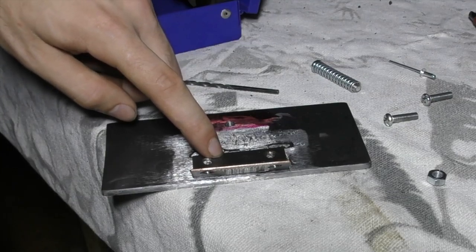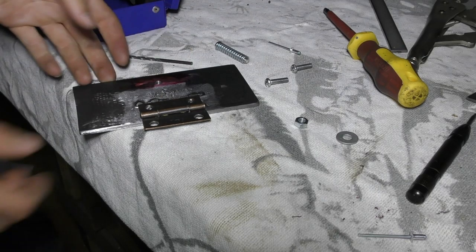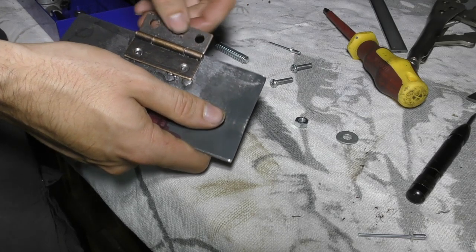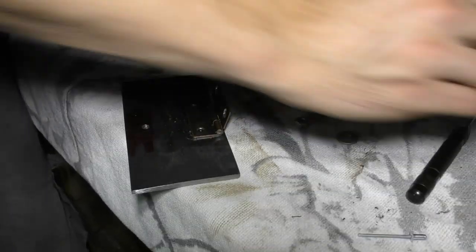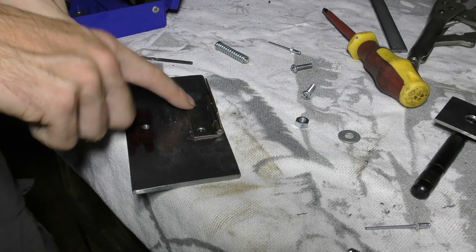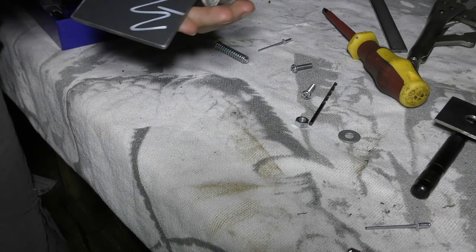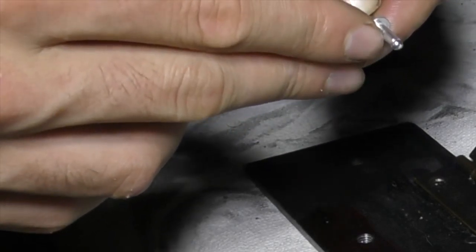Okay, so at this point we're about to finish fixing this hinge onto the base plate, and then we're pretty well onto some final touches. As of right now, we've got the hinge currently just epoxied onto it. I did originally have it welded, but that was a different hinge. I've decided against welding it — not because my welding sucks, I mean it does — but epoxy just seems to be holding it well enough, and it's a little easier to epoxy something on because it means I can line it up as it's setting. You'll notice I've drilled out these holes on the top half a little bit larger — that way when I thread through these I get a good bit of play so I can make sure everything's as square as I can get it.